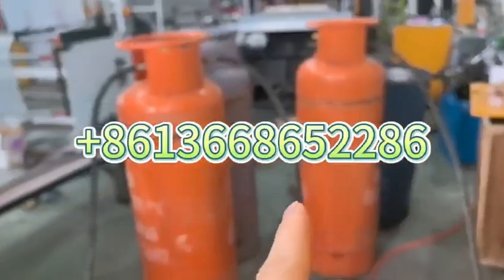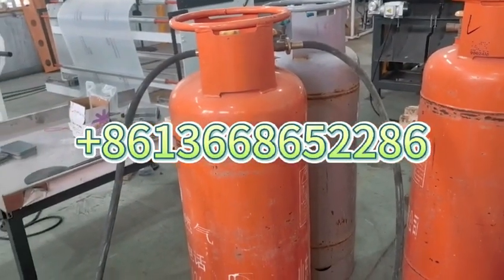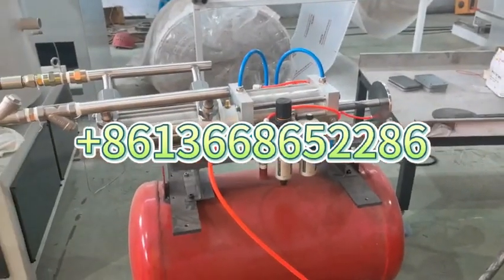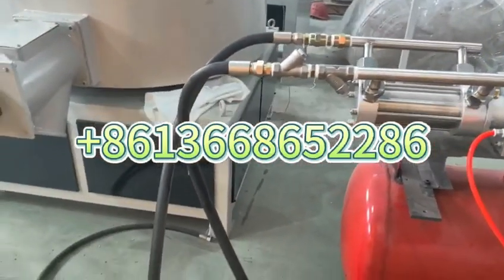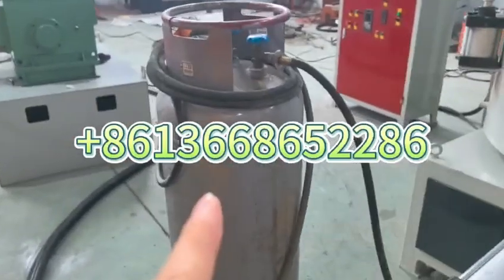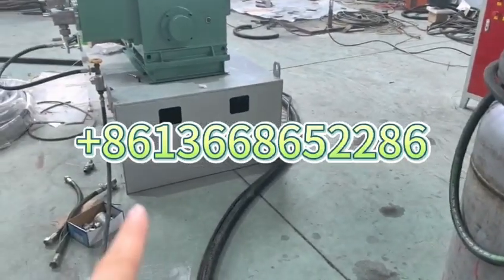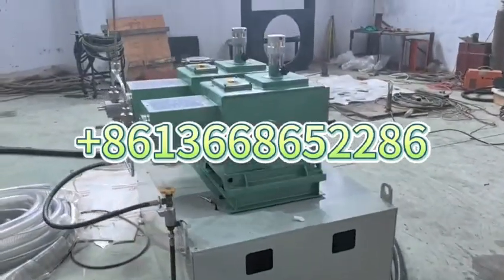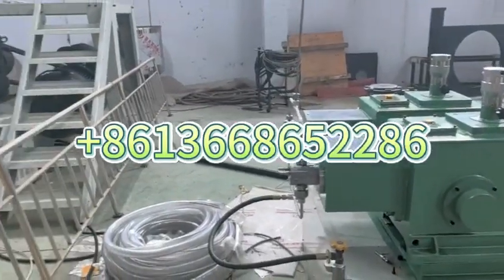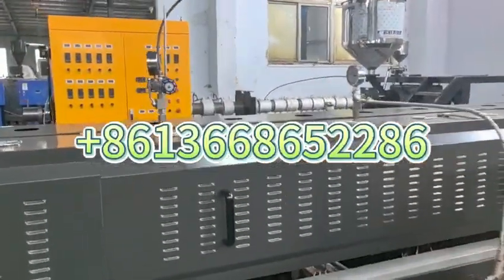The tank with the gas — on your side, you can prepare a big tank for gas. So the gas goes through the pipe to the booster pump. This is the booster pump, to increase the gas pressure to 1.3 MPa. And it goes to a tank to keep the pressure stable, then goes through the pipe to the high-metering pump. From the high-metering pump, it injects to the screw. This is the pressure.